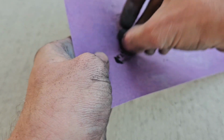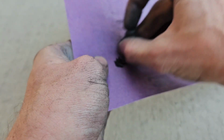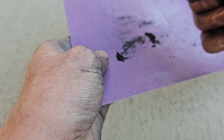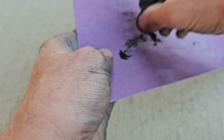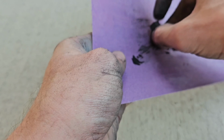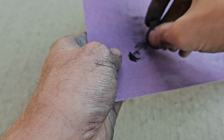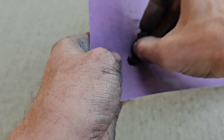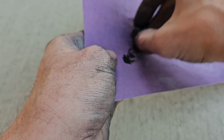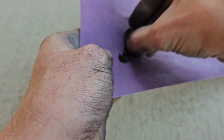There's no real specific spot at which the model is too thin for metal to flow through. If you get it reasonably hot, the silver is going to flow for a short distance through a hole that's less than a millimeter wide. The question is, how far will it flow through the entire length of the ring? And that's more a point of increasing difficulty rather than a point where suddenly it stops working at a certain diameter.